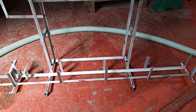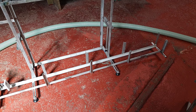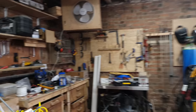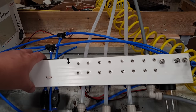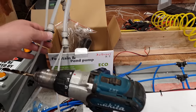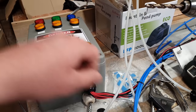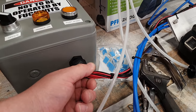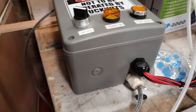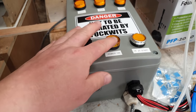Then we install all the electrical components. I brought the laptop in this morning — we're going to do some prototyping to make sure the code is right, and maybe at the end of the day we'll see this in action. So the control panel is on the side in here. I've taken off the solenoid rail — we've got the solenoids on the back of this piece of PVC, here are the feed lines which loop round and over the top. On the panel I've gone for black-and-white and black-and-red speaker cable sending 12 volts to the associated solenoids. We've got braided flex coming in here with 240 volts, which just powers the on/off switch, the indicator light, and the 12-volt power transformer inside. Everything else is 12 volts.